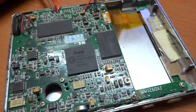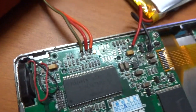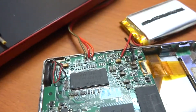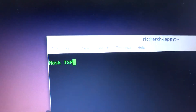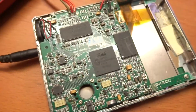The other thing it has is a couple of AV ports right here, and I've soldered some wire to it. The only thing I was expecting was some sort of a boot log, but the only thing I get is 'mask ISP' — I'll just show it to you. When I plug this in, that is all I get: mask ISP, and that keeps flashing. Nothing else, even if I'm pressing any other key. So that's all that happens. Again, a very small second channel vlog — thank you for watching.